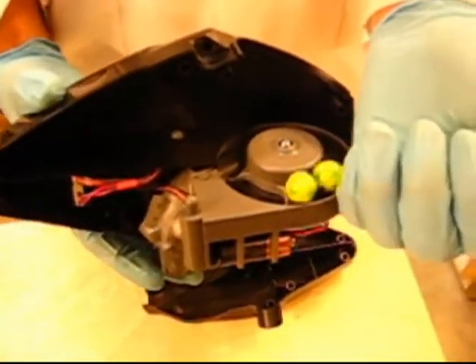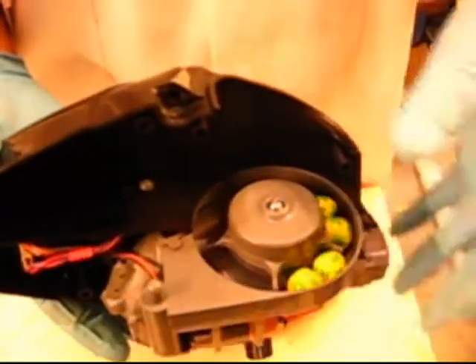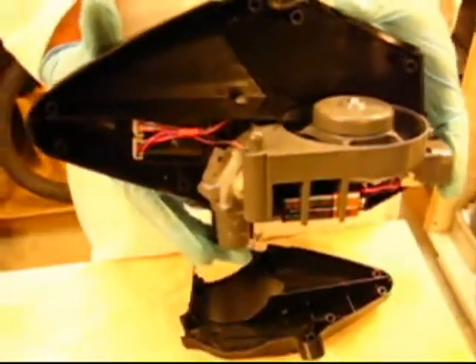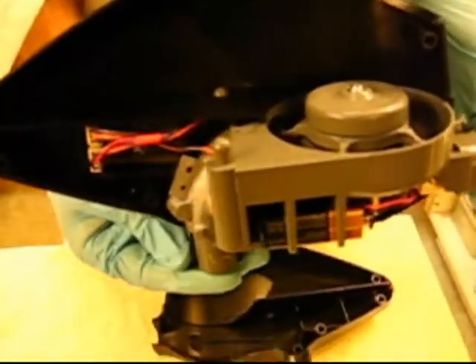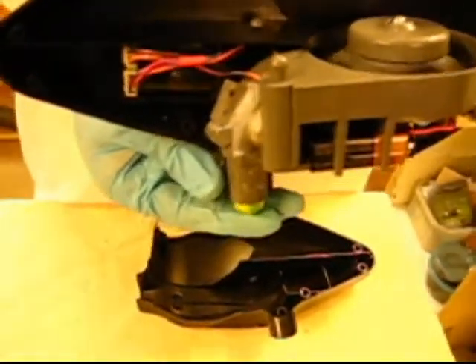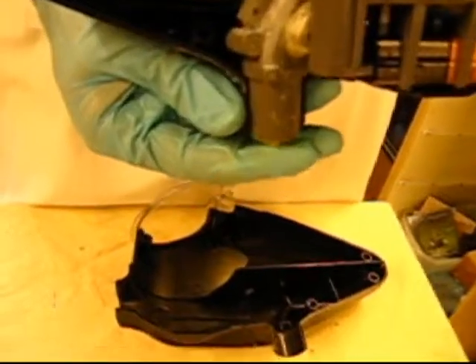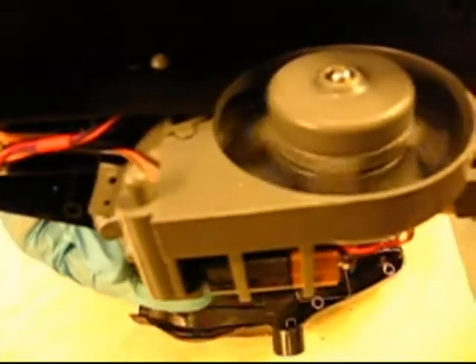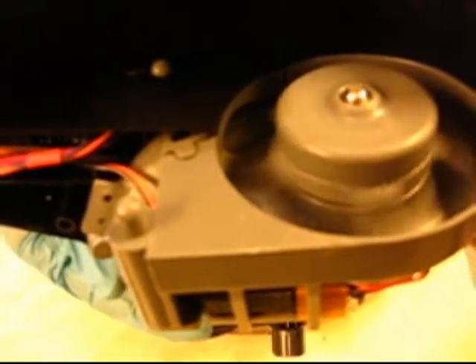With our modification, loading paint into the hopper and feeding down the stack stops the clutch from spinning. The paint balls are now blocking the infrared eyes. When I fire, the hopper pulses. No more annoying noise. No more wasted battery power. Just operation when you need it.